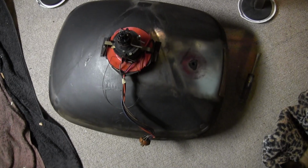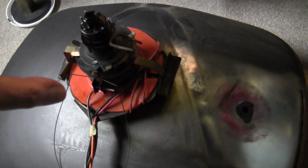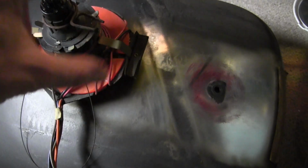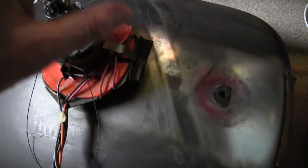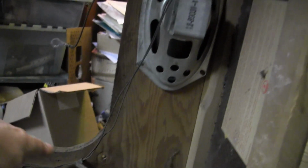Success. Yeah, you do have to take the picture tube out to get the bezel out. But the yoke assembly and the adjustment magnets, all that stay attached to it undisturbed, so that's one good thing. The reason you have to take it out is there's a screw that goes in straight up here, and you cannot get to it unless the picture tube's taken out. Once you do, take out the 4 screws around the perimeter, and this whole assembly comes out.